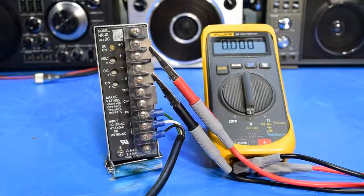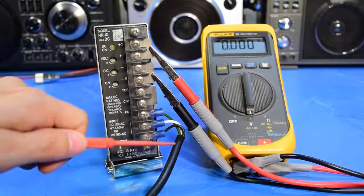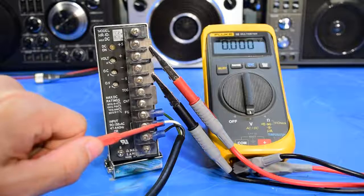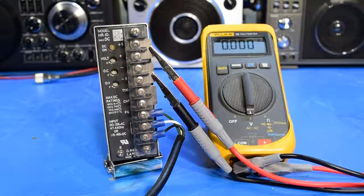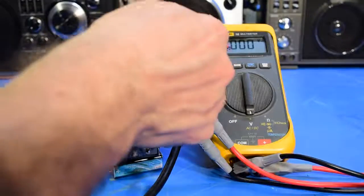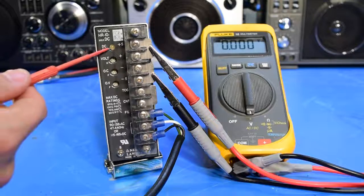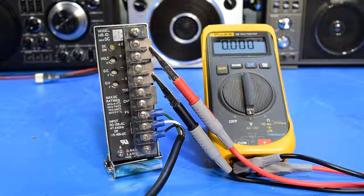The upper four terminals are the output terminals: the negative output, the positive output, the positive sense terminal, and the negative sense terminal. In most applications these are shorted with a jumper, but if there was a precision need you could hook up sense wires to sense the voltage drop in the output wires. I took an old computer power cord, cut the end off, and wired it up with fast-on terminals. I've got it ready to plug in — when I do you should see the voltage on the meter go up momentarily, then back down, and the red power light will turn on at normal brightness and then start to dim.